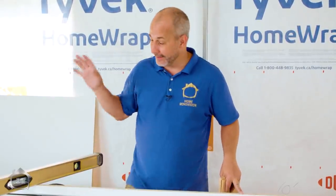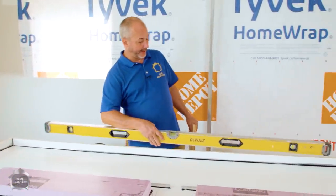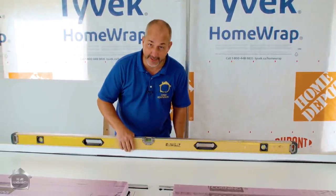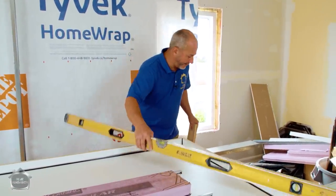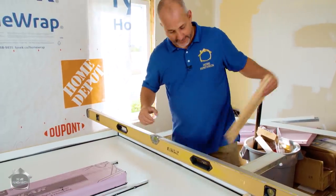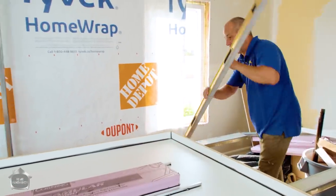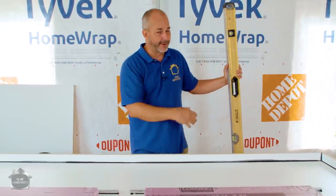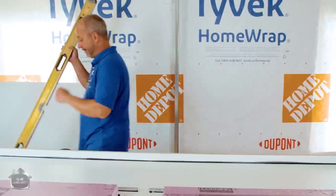Everything is nice and dry, and now I'm just trying to make sure that my countertop is completely level. And here's the reason. You can't fill everything to 2 inches if you have a sloped corner. Oh, yeah, there is a weakness over here. I knew that. I walked in and I saw it. Here we go. So let's get that taken care of. Oh, all right. Now, only one other thing we got to do before we start mixing up our cement, and that is to vacuum out the interior. We don't want to have any dirt embedded in the finish, right? So that's key. Here we go.